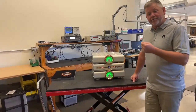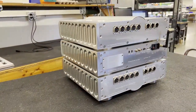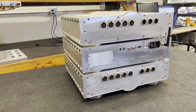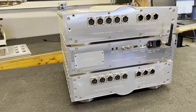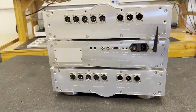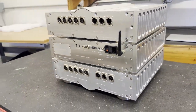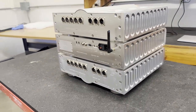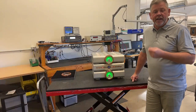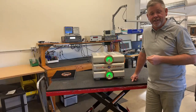From the power supply, we feed signals to the two audio chassis, and in the audio chassis it's just that — there's only audio circuitry. All balanced inputs on the back, balanced outputs as well. The circuitry itself is something we had as a concept a number of years ago. We wanted to test out the idea of using a FET as part of our input stage. That circuitry ended up in the Momentum Preamplifier, which became our Momentum HD. But here in the Relentless Preamp, it is the fullest expression of that circuitry.